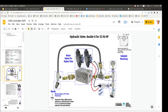So this is actually something that I am curious about. For some of the simpler applications like a shredder or a chipper, it's not as important. But if I am building towards a tractor with attachments and all of my lines stay full, I think the sizing of the hydraulic fluid is important if I'm going to attach them. If I need to move the tractor itself, that's one thing. But if I need to move the tractor and then power all of these attachments that are doing other functions, then the amount of fluid in the system has to be sized to be able to do that once I start attaching things, right?